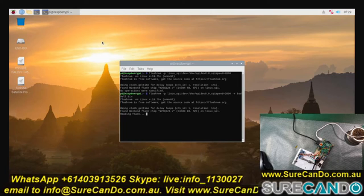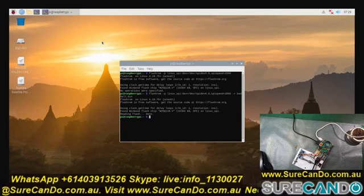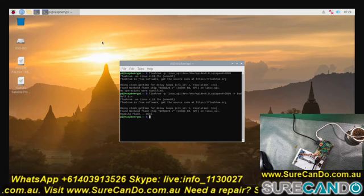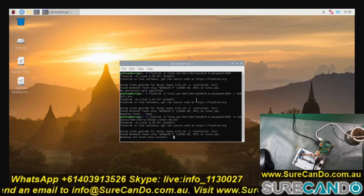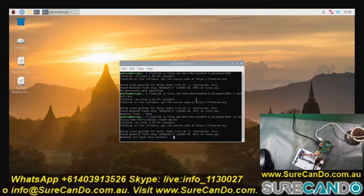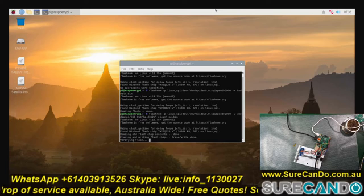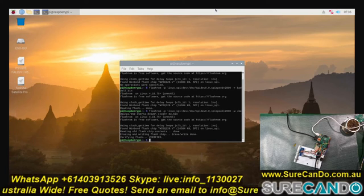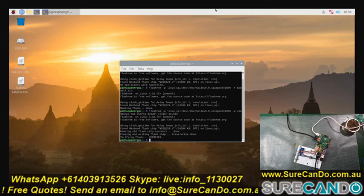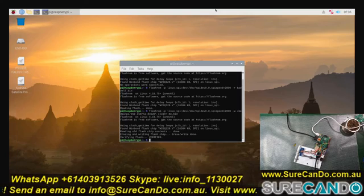And this command did run successfully. I did manage to take a dump, and now I'm going to flash it with the new data. Here we go, now we are writing the new data. Let's see how it goes. Here it is, we're done. Now the job is to put it back on the board, and let's see if the system will boot.